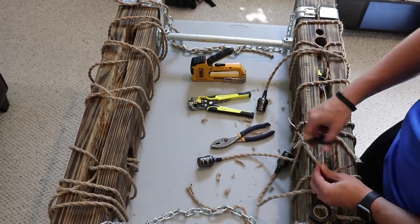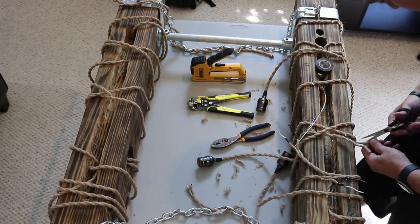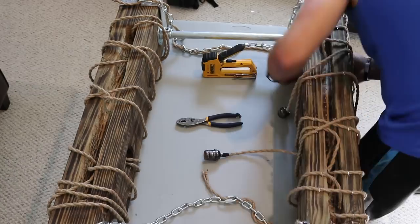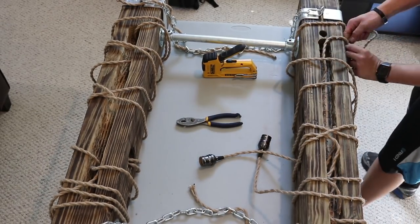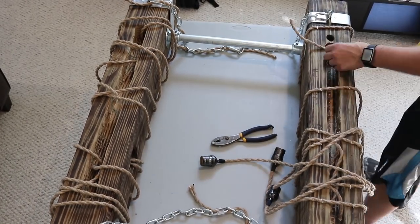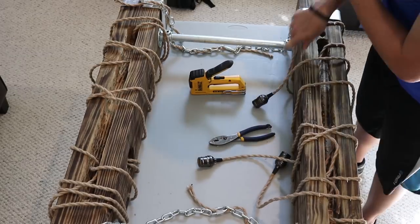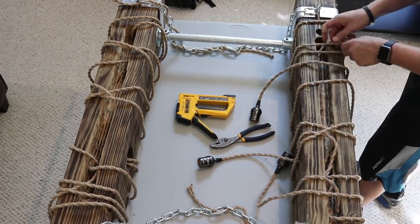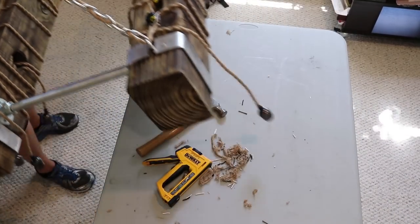I worked from one end of the beam to the other. When I got to the other end of the beam, I added an additional pigtail out of the grouping that would go to where the chain came down to the beam, so I could run my wire through the chain and connect it to the lights. Once you have all the wire connections done, carefully — without putting any tension on the wire connections — take and secure all of your wire to your beam using staples. I used 12-millimeter staples with my staple gun, but you could also use electrically insulated staples from any hardware store. Once the wire is secured at the top, pull the rest around the beam and secure it once more before the strand goes down to the light.